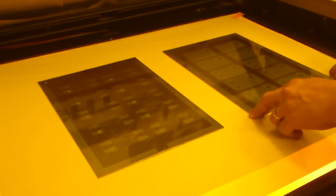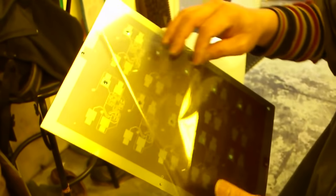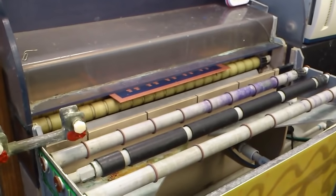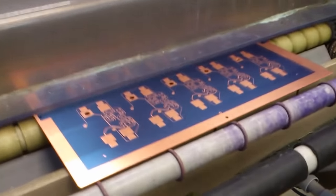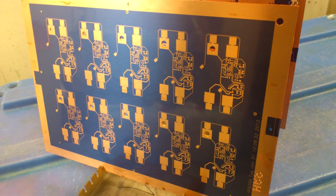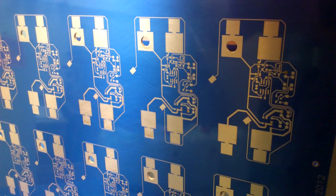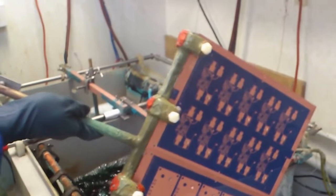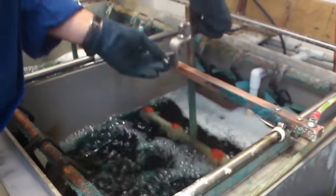They take the film off and you can see the photoresist now has that exposed pattern. This is a negative photoresist, so it generates a negative image from the positive film. Next they peel the dry film off and whack it into the developer machine — a big machine with rollers and developer chemicals. It goes through, develops, then washes. Now you can see what pops out of the developer: it's a negative photoresist, so you can see the exposed pads in the copper. If you were etching at home you'd whack it directly into the etching solution now, but in this case we've got exposed copper on a negative — you'd just eat away all your circuit and end up with a negative image board.